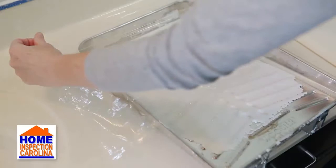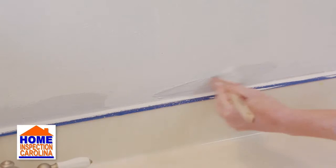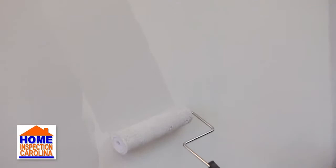If you start painting but have to take a break before the final coat, be sure to cover your roller tray and any paint cups. Also, wrap your rollers and brushes with plastic wrap or a plastic grocery bag. If you must wait longer than 24 hours before your next coat, you may need to rinse out your brushes to store them and throw away and replace any used rollers. You don't want any dry paint on them when you start back up again.